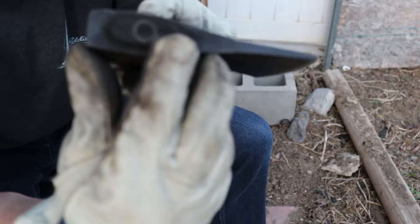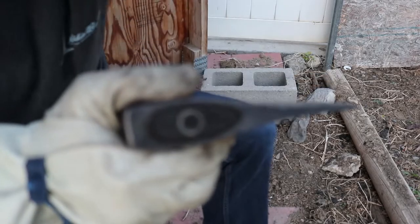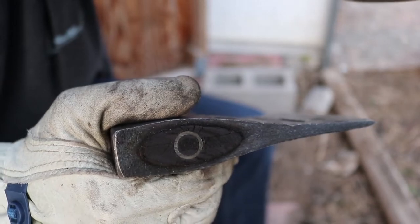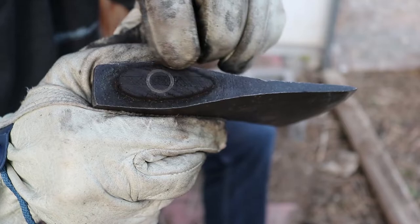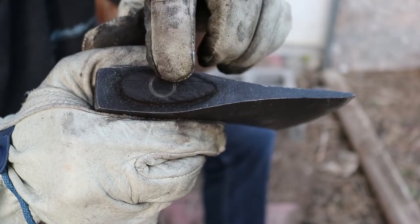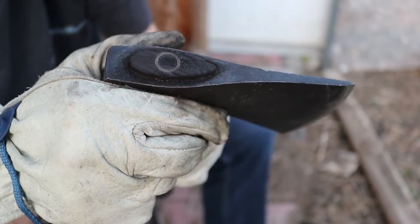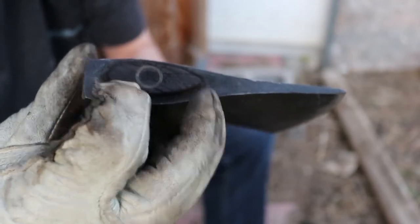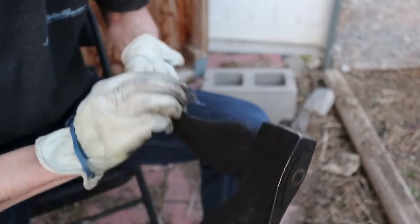You do something similar to what's here, right across the middle. Come on, let me focus. There we go. So something similar to what we've got here, except you can slightly make out there's a wedge of wood that goes lengthwise here. And then they put that circle thing that they pounded in there, which I suppose is good enough, but typically you'd see two cross wedges going opposite of your lengthwise wedge to hold the head in. That's the proper way of doing it anyway, at least from what I know.